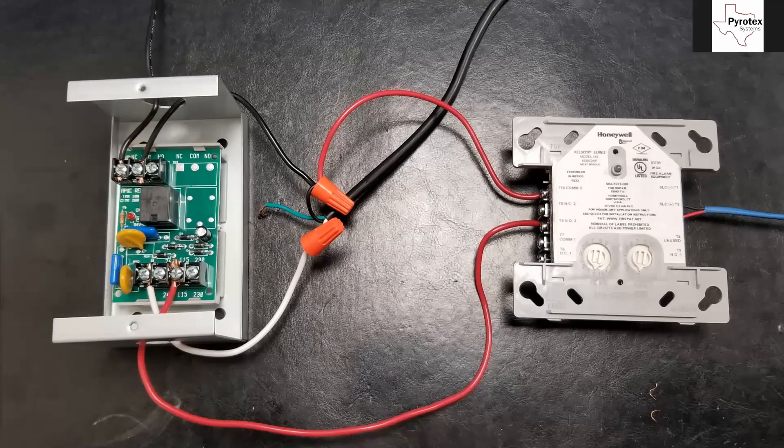This is how a damper is going to wire up. If you have a building with multiple damper circuits, you're going to have to install something like this multiple times. If you've only got one damper circuit, you only install it once. If you're not sure how many dampers are on the circuit, go ahead and install the MR-101 like this — it's better to play it safe than sorry. It would be a problem if there were just a third damper on the circuit and it fried the relay. Having to come back out is a warranty call and costs way more than just putting it in this way to begin with. The small price of the relay during construction is a lot cheaper than the warranty call later.